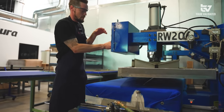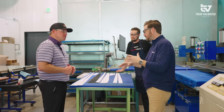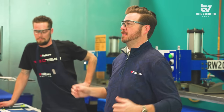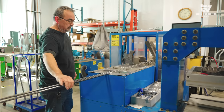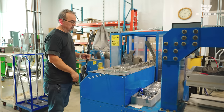There are a lot of geometric shapes going on. This design is a mix — we'll have some different tonnages, different weights, and a few different things going on, especially for a driver given the club length. We want to be very particular about where we place weight. Now that we've gone through cutting, rolling, and wrapping, and it's been in the oven, the graphite is nicely cured. What we do now is extract the mandrel it was rolled on. That's what this machine does, and what we're left with is essentially an empty graphite tube — a graphite golf shaft.